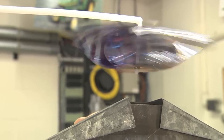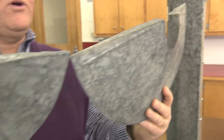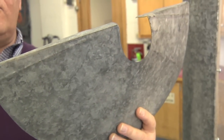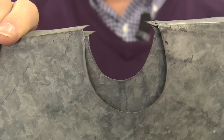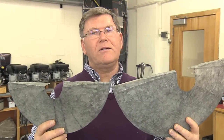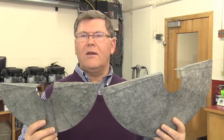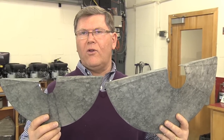Why would that be? This is actually a little trick I put into the demonstration. If we compare the size of the two openings on the bin roofs, the opening on the small bin roof is very small relative to the opening on the big roof. We take the airflow, crowd it down into a small hole, and it shows a lot of velocity — not necessarily quantity of airflow, but speed of airflow. This is common: people report good airflow because air is whistling out the top or blowing their cap off. It's critical that we're aware of not only the velocity of airflow, but the quantity of airflow, which is more difficult to measure.